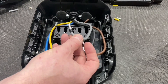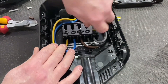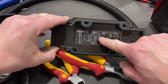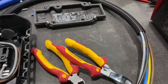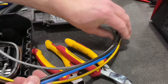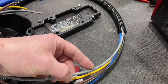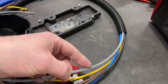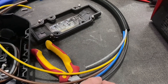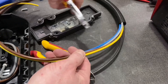We're using ferrules in this instance because they're going into a screw-type terminal - there's no cage clamp in there. If we didn't have a ferrule on there, we could damage those class five flexible conductors. Gentle twist, in we go - a few strands hanging over the end and crimp it up. I'm making the connections in the EZ EV charger, but I'd leave the actual tightening to the required torque setting to be confirmed on site. The beauty now is I know the lengths at the other end, so I can cut and ferrule the other end. I've gone a little bit longer than the 150mm recommended, since the tri-rated cables are more flexible to bend around, and they could shorten as you bend and flex the conduit, so you probably need that tolerance.